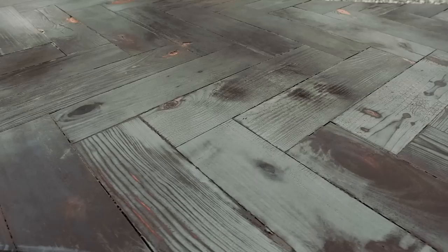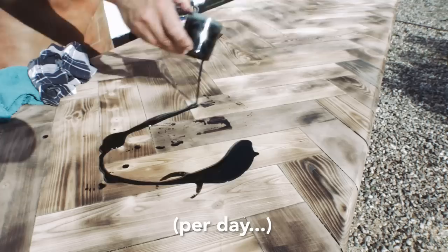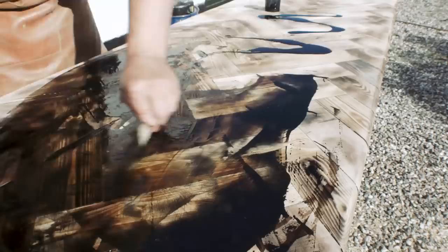When I burned it, I realized that burning was really just a quick way of getting the finish off, and it also gave the wood the brownish color I was looking for. So I sanded the burned wood back a bit, and very late Thursday night I settled on Rubio Monocoat Walnut on top of the sanded and burned wood. Because I was in the very last hours of the last day before my boss returns, I really needed it to work.